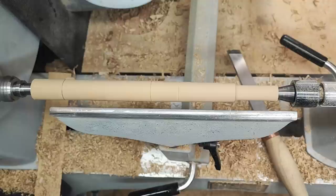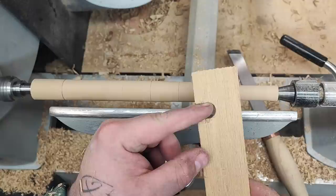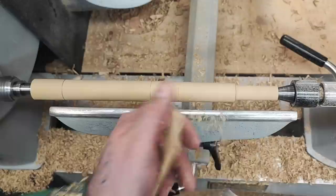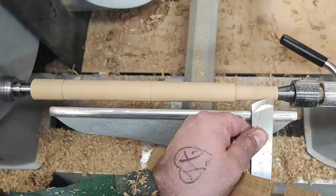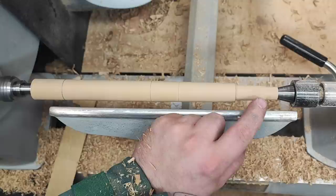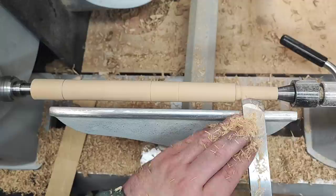So I have this little jig. So this is 15 diameter, the Forstner bit hole, and you just make it flat up to the highest point of the hole and you can gauge it. Okay, so this burnish mark here is, sorry, my perfect fit. So all I want is now make it parallel. You can even make it slightly tapered here.